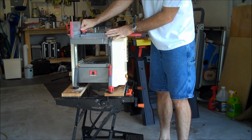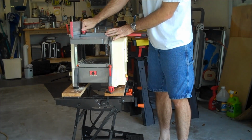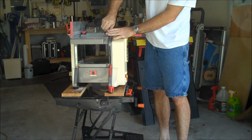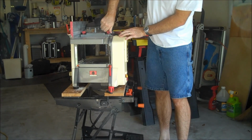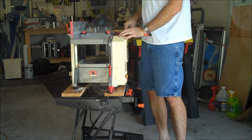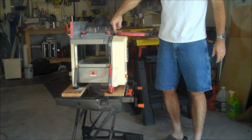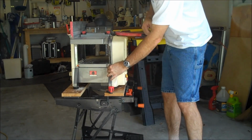And like I said, the planer will not work at all if you don't have the collector on it, because it doesn't have the proper little hold downs to engage the shut-off switch, or the anti-shut-off. So now it's locked down. It's all good. Basically, there's a little tab here that holds this out, so it's out of the way of this. Make sure this is loose.